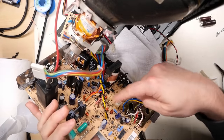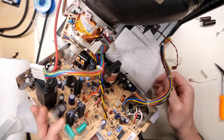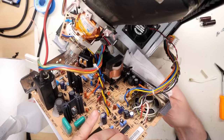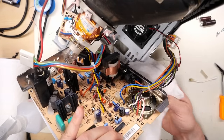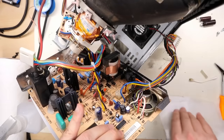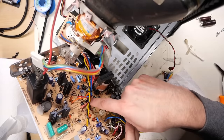And on Mac Classics, these brown caps I took off, they are problems. They're always problems. Now what I'm also doing is wiping the edge of the board here and getting all that stuff off there that was visible on the backside or when we lifted up that plastic shield. And just looking down here, things looking pretty good.